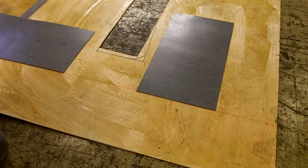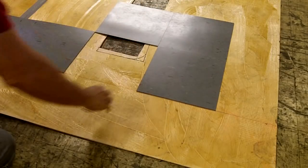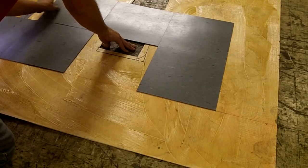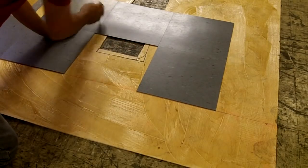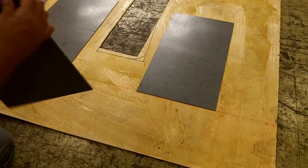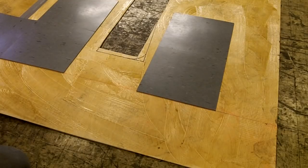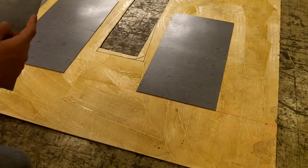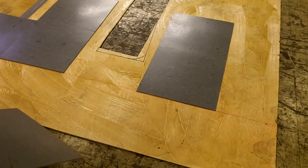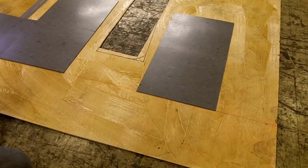Anywhere you have to skip a spot, you will be sure and put a tile down as a gauge. And I've already wiped the tile side of these tiles down when I open the box out of the factory. There's some dust and small residue on the edges. It don't sound like a lot, but if it has 1/50th of an inch more dust than the other tile, you know, in 25 feet, you're running off a half inch, and then your corners won't meet up right.